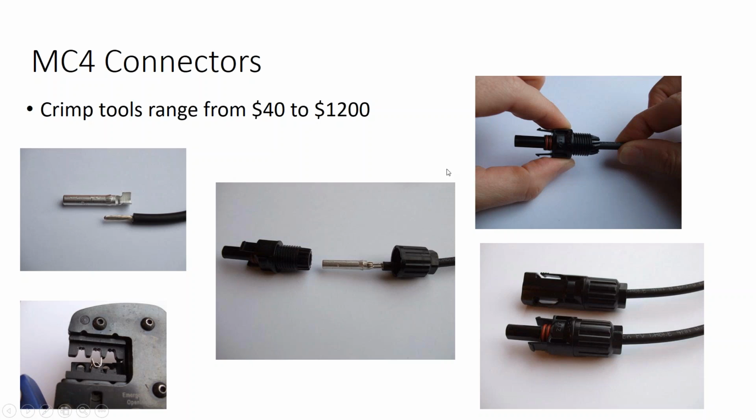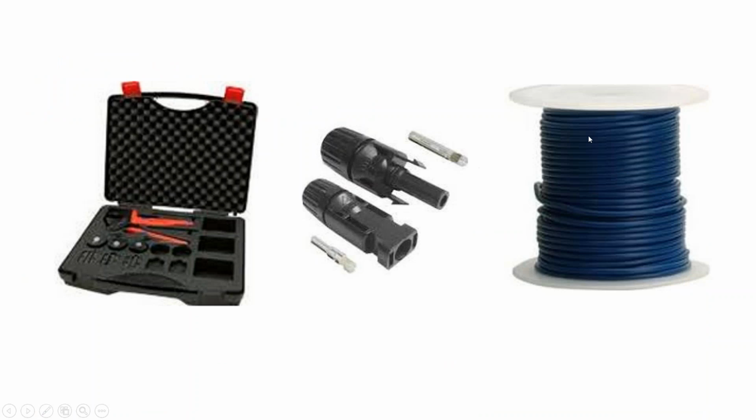Now here are the MC4 connectors we talked about earlier. Some pictures of the process of making them. This is like the number one place that you're going to make a workmanship error, other than squaring the array. This is more of a specialty skill. You have to take your time to make sure that these things don't slide around after you crimp them on. You want to make sure that the crimp holds. There's a specialty solar cable. It's just called PV cable, PV for photovoltaic. Basically it's a single conductor cable like THWN, but it's a thicker gauge cable. It has a thicker jacket.